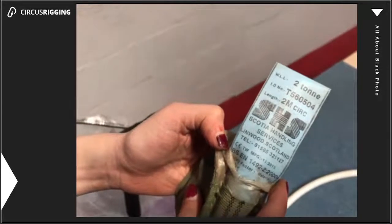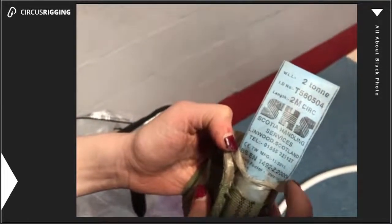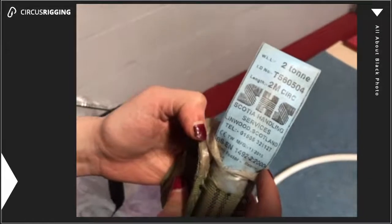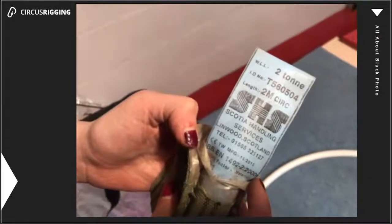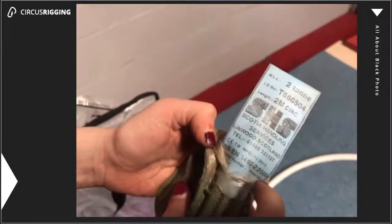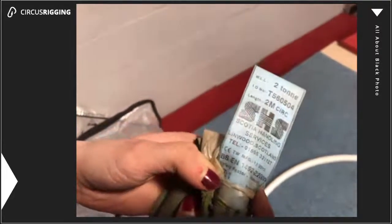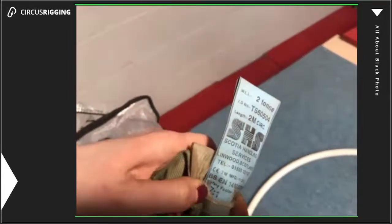It's quite useful that you've actually got Scotia Handling Services' phone number there as well, assuming they're still in existence, which I'm sure they are, because if you've got any questions, you can phone them up. And that's why the cheap kit that might just say, perhaps just the country where it was made, is not very helpful. Now, right down the bottom there, tucked away under your left thumb, more or less, it says safety factor as well, which is worth knowing, isn't it? And it should say 7:1. I think it does. There it goes. Yeah. So, nice.